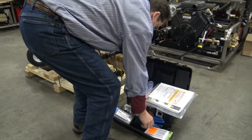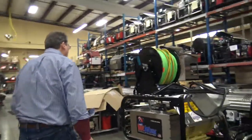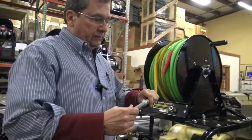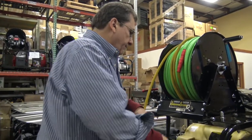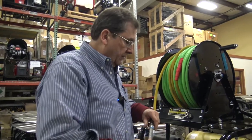Another key component of safety is attaching an extension to your nozzle, so the hose won't come back at you. This is called a stinger in the industry. This doesn't have enough high pressure to cut you in half, but it's probably close, so you want to be safe. You don't want to have that nozzle come back at you.